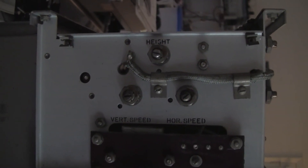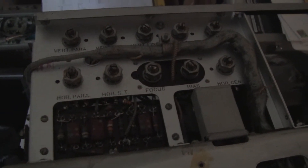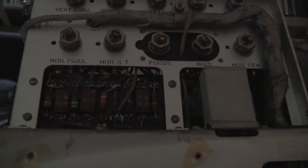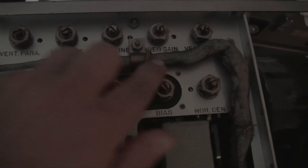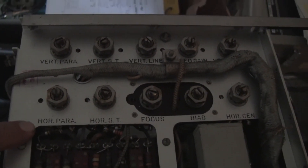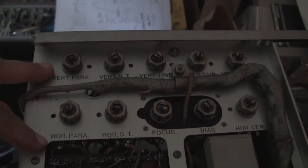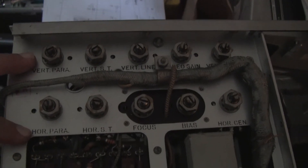There are also a large number of adjustments on this camera, though the circuitry is extremely simple for the job this camera had to perform. Here you see a large field of adjusters that set all kinds of parameters — horizontal parabola, for instance, refers to a shading correction; vertical parabola as well. The iconoscope tube doesn't sense light evenly across its surface, and these correct for that to make the brightness field flat.